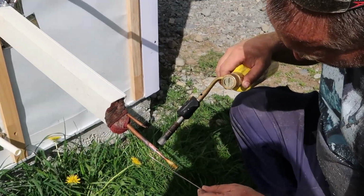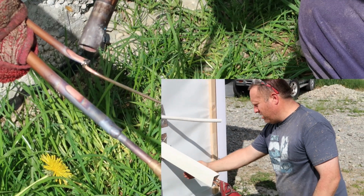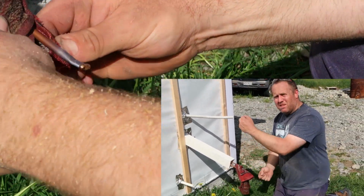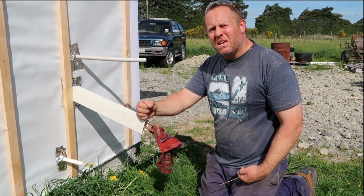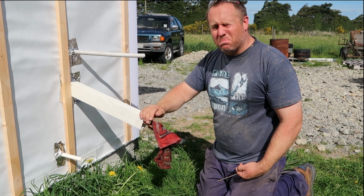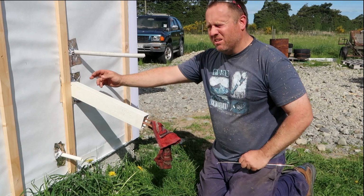Now the reason why I have this 550 long is quite often, even if you have them short, builders and particularly brickies, if there's brickwork here, the bricks would come out to about here, and quite often the brickies will just bend them out of the way and they'll kink the pipes, which means I have to cut and join them. So by having it sticking out this far, there's no way that they can easily bend the pipes without being blatantly, excessively malicious. So this is just so our pipes don't get bent, so I can come along and flare them off and stick them to the units, or if it's a bit too short, there's still enough for me to cut the weld on without getting the flame anywhere near the inside of the building paper. Right, putting the high pressure gauge on.